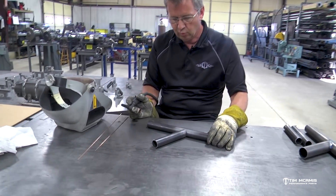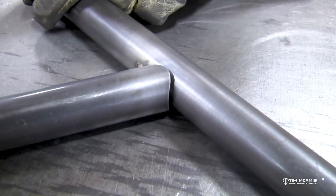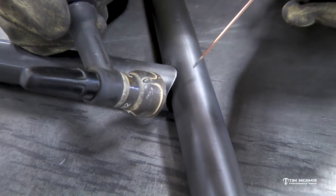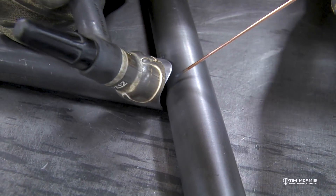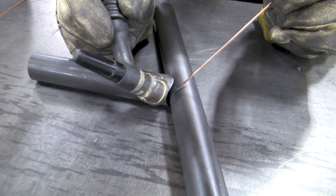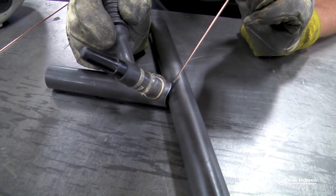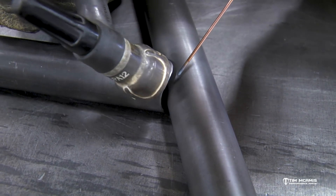I tacked this tube together — this is just some one inch 058 here — and I tacked it together so it's got a gap so that I can kind of show you what to do here. You've got to be really careful because you're going to have to kind of pull this back and forth and use your rod to weave over this. Sometimes even a little bigger rod will help, but you don't want to get it so big and so hot that you turn it into a monster weld. This is a pretty big gap — about twice as big as our 16th rod, so that's a good eighth inch gap. Any more than that is going to be really hard to deal with.